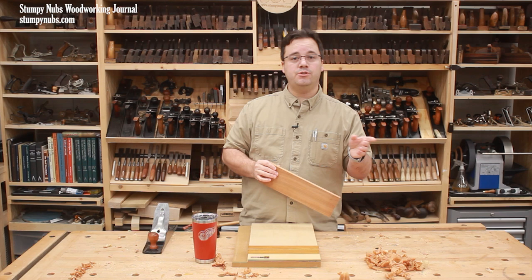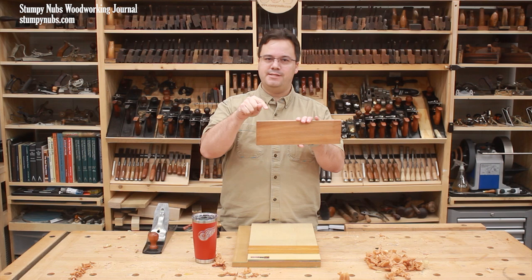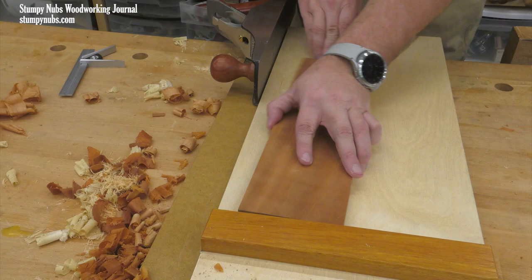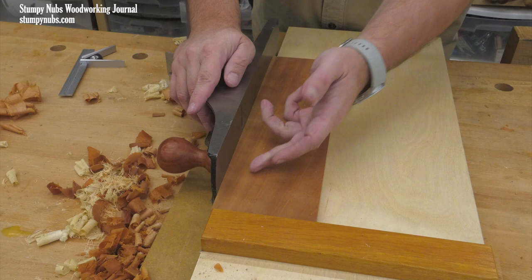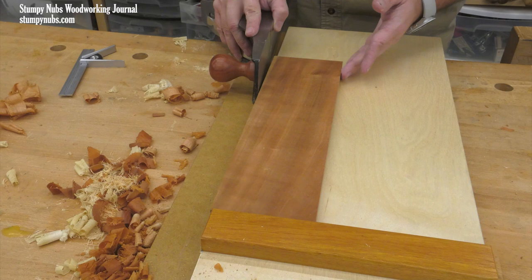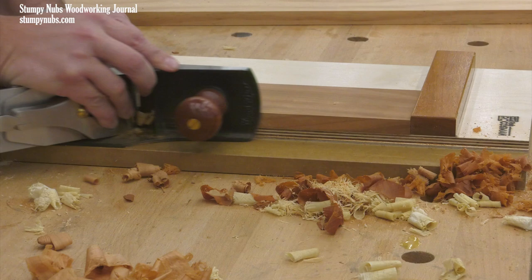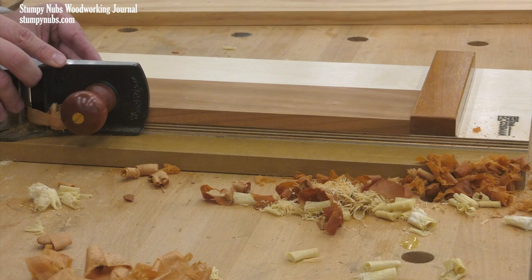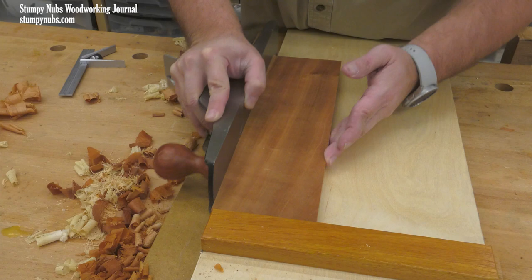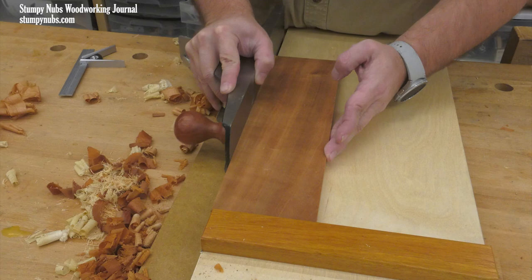Whether you are using a table saw or a shooting board, it is impossible to get a square end if the reference edge isn't straight along its length. A shooting board can take care of that as well. If the board is narrow, it would be impossible to reference off the shooting board's fence, so my only concern is straightening that edge, and that means keeping it against the sole of my plane. As I apply pressure along the opposite edge, I follow the plane down the length of the board with my hand. This is really the easiest way to edge joint a small or even medium-sized work piece, even for glue-ups, because I am not only making it straight, but the shooting board jig itself ensures that edge is going to be perfectly square to the face of the board. I won't get ripples or tool marks like I would from a power joiner, and I can work with smaller stock than I can safely do with a power joiner.